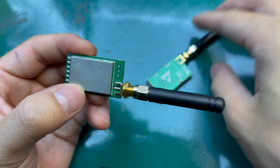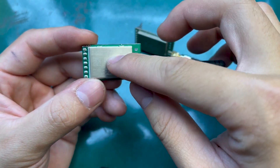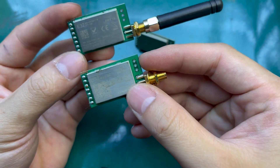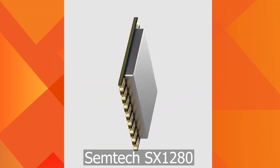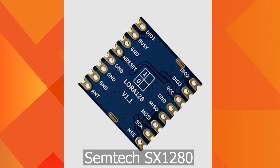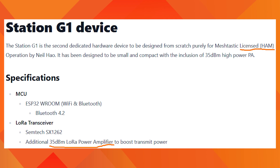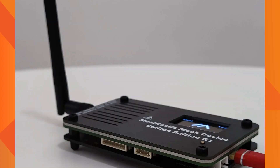The third critical component is the LoRa transceiver. We should have a Semtech SX1262 or better, which provides around 22 dBm — equivalent to 100 mW. There is also a global or worldwide option using the 2.4 GHz band, for which the Semtech SX1280 is a good choice. The Lilygo LoRa T3S3 has a 2.4 GHz option, as do other manufacturers. Note that Station G1 requires a ham operator license due to its additional 35 dBm power amplifier.